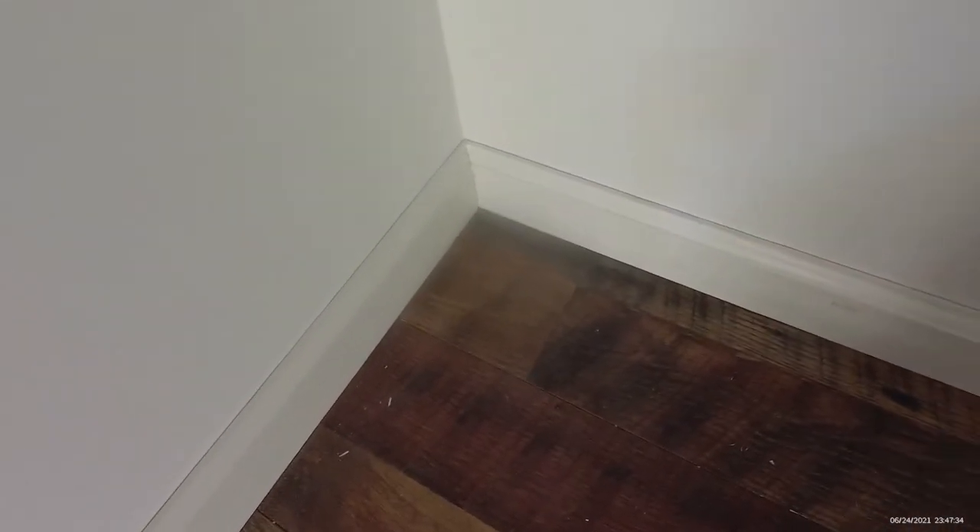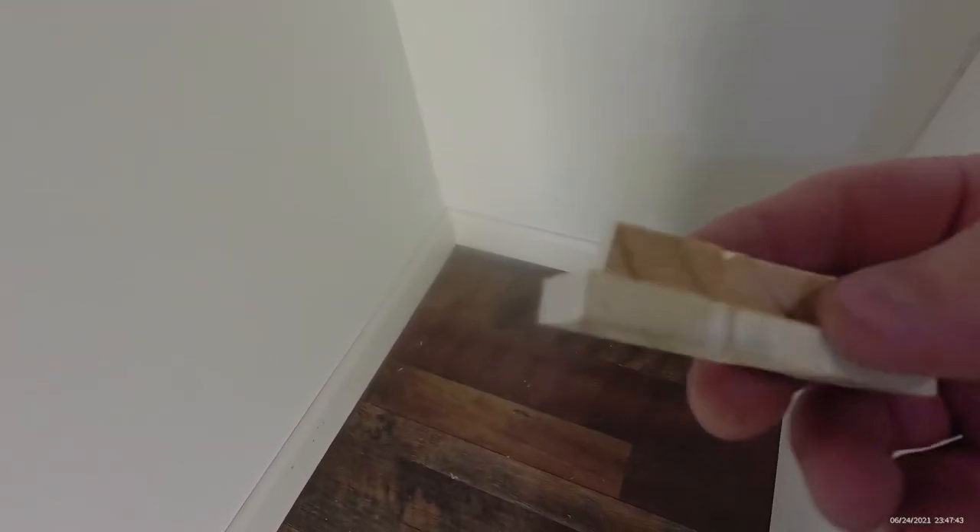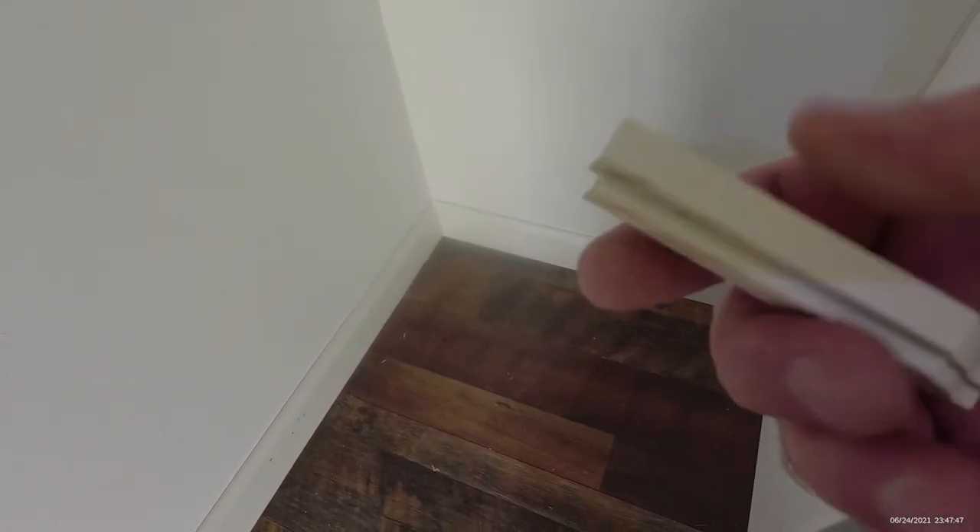You can slide this cope joint in — it goes right over top. It's a little wide at the bottom, but I know it's got a perfect 90-degree corner on it. The top's held out just slightly, but it's a good enough cut that when you stand back from it, you can't even really tell. When the caulking around the top of the trim and the nail holes is done, you'll never even see it. It's a simple, easy way to join a corner — made a lot easier when you put the little trim blocks in behind it. I just cut random lengths of waste trim and stick them in my pocket. You really only need them at the corners — that's the only place it matters. But I do put them along the length just to try to keep it 90 degrees to the wall, because it will sink back in about an eighth of an inch when you nail it.